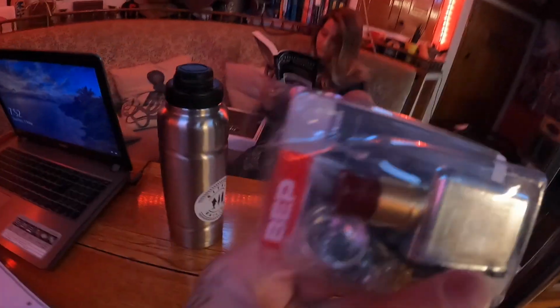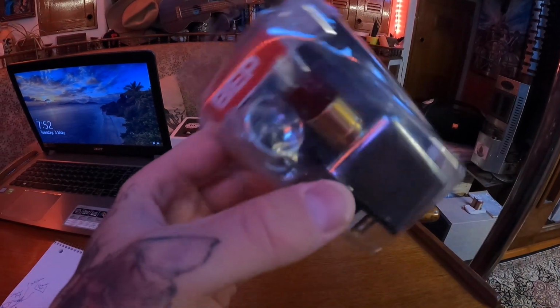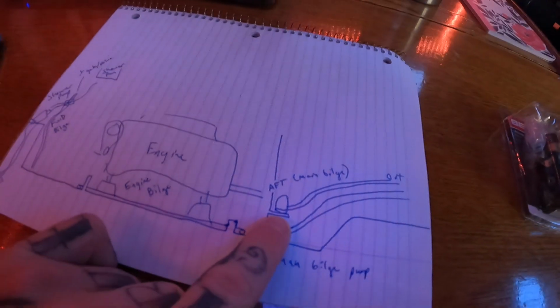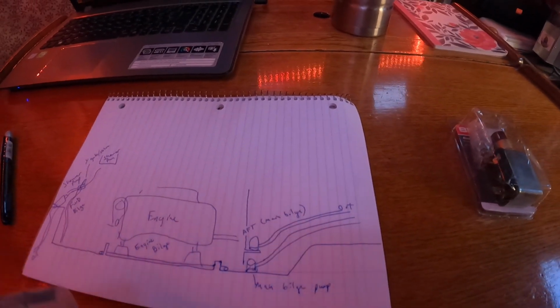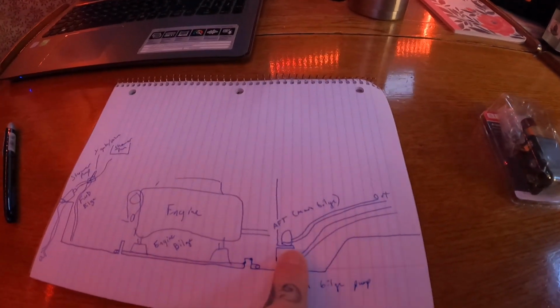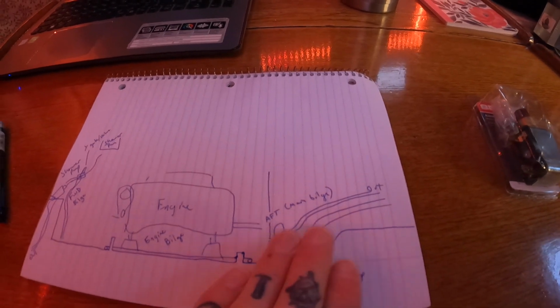And we're also adding an alarm, which I have here in my stock of things that I have to install. So this guy here, which is another audible and light alarm, is going to be wired separately in the cockpit. So whenever water reaches this pump, which is above the main one, we'll get both audible and visual alarms inside the cabin and outside at the helm. So even if the engine is going or it's blowing 40 knots, we will not miss that alarm. So that's our main bilge system set up.